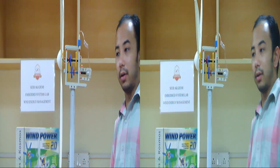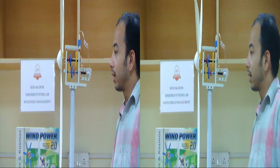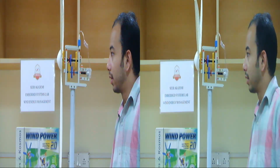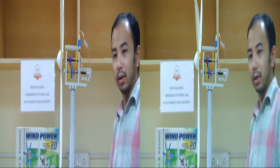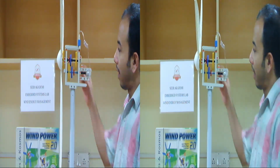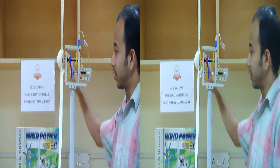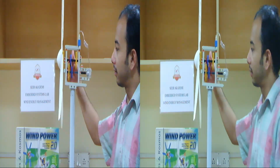The radius of the red wheel is 1 unit, the radius of the blue wheel is 2 units, and the radius of the yellow wheel is 3 units. As we know, the circumference is directly proportional to the radius. So, for every 3 rotations of the red wheel, you have 1 rotation for the yellow wheel, for the gear system on the left hand side.